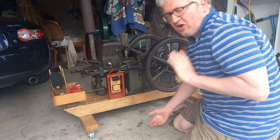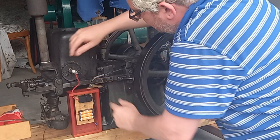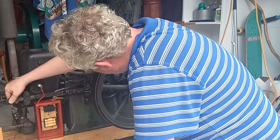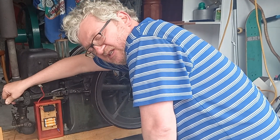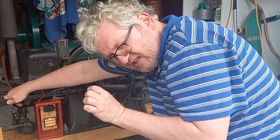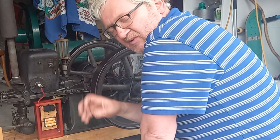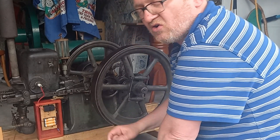I've been trying to get the clonk-clonk sound from here to be a little bit less clonk-clonk. I've adjusted this a bit and changed the ignition point. For little engines I do them at around top dead centre — they have a tiny little volume of petrol-air mix, so the explosion is very fast. With a bigger volume the explosion takes longer, so you want to start it earlier. People have been saying to me: why run them at top dead centre? Run them at 10 or 15 degrees before. Well, in this engine it's really made a difference — we're getting a really long miss cycle.